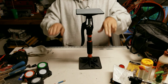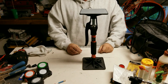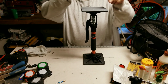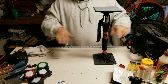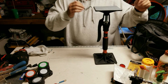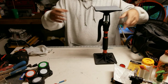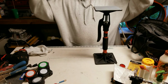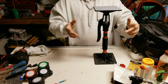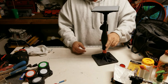Now, get your bottom cabinet set. You can put this on top of your bottoms cabinets. Now your top cabinets, like I said, I have 4 of them in here. You can assemble 2 or 3 cabinets together at one time, whether it be 18s, 24s, 30s, 36s, whatever your cabinets are. You can put several together, put these up there, lift them up. Once you lift them up, you can put them on here, and these take all the weight. I think these hold up to 150 pounds a piece.